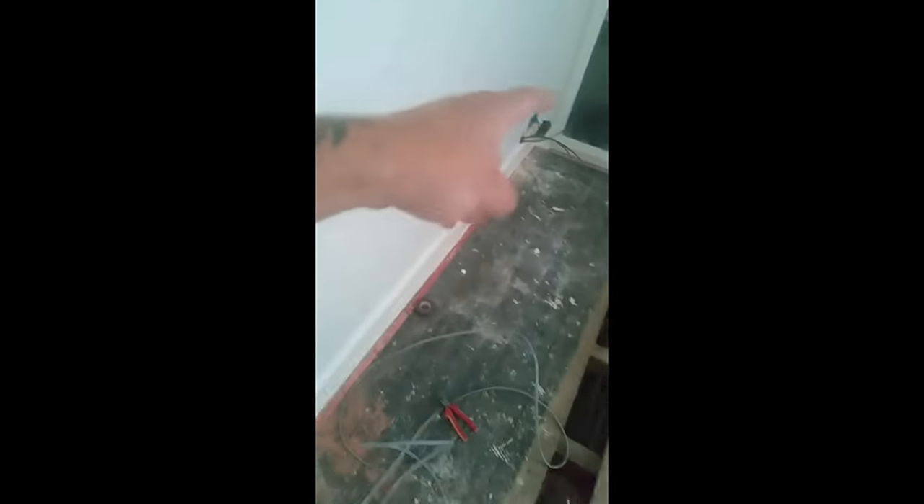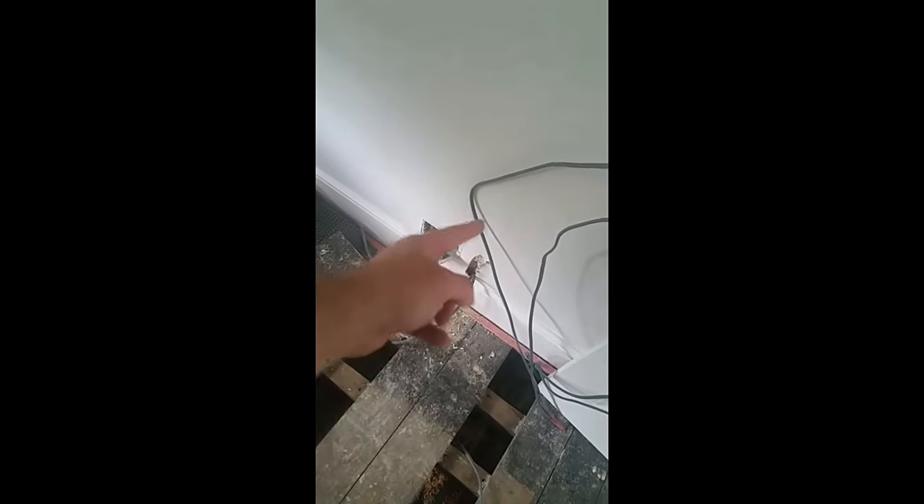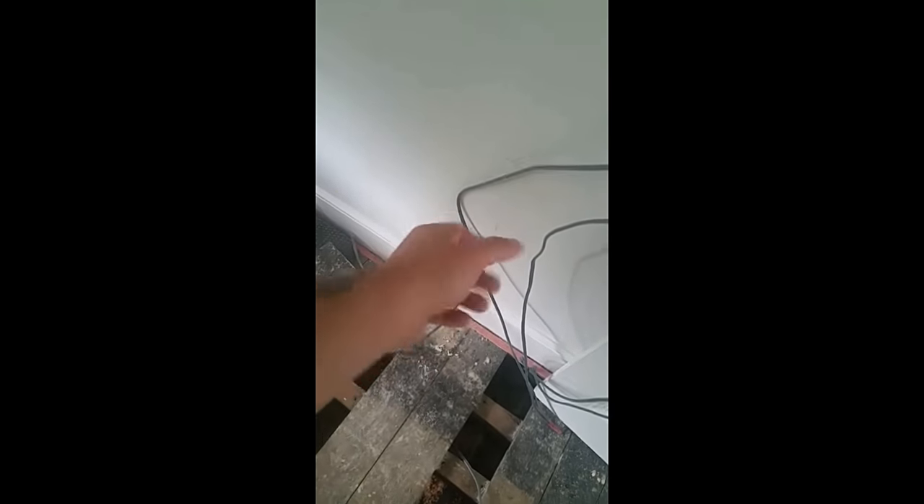The bigger carpets we've just rolled back. This is a lot of downstairs wiring. Again we've got a socket there, a light switch, a socket there. Obviously you can't do anything over there just yet because we need to get to it. What we're going to do is — obviously these sockets are a little bit higher — so we're going to cut the boxes in, try and get them live, and the day they're live we cut them out and put some bonding in. So that's our method around that.